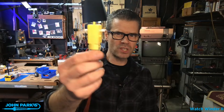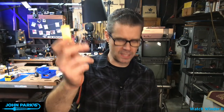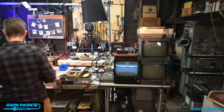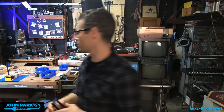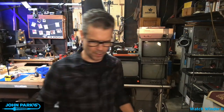The thought I had was, what about using one of these little TT motors? They're easier to work with, they're simpler, they're cheaper, and not insignificantly, we have a little adapter that goes from this flatted shaft to the Technic cross axle. I had to mangle one, carving off part of its interior and banging it on with a hammer to get it to work on this stepper, and I didn't love that. So I'll leave that one on there now that it's there, but I decided to give this a try.